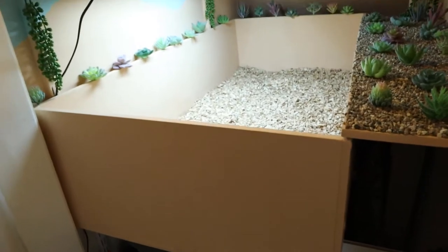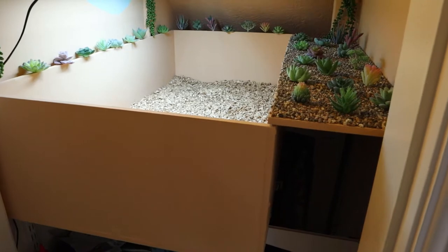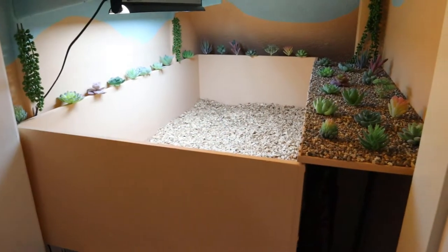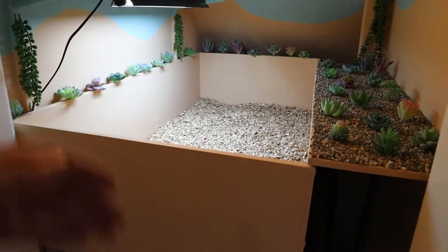If we start with how we actually fitted it up here off the ground — we put brackets into the wall, so there's brackets into this brick wall here on the left, and then on the right we did brackets into the studs. Then there's bars across which support the actual weight. There's 80 kilogram weight bearing on each side, so it's more than enough to keep this guy safe. We basically went to B&Q and got a load of boards that we cut up. The bottom is one pre-done sheet and then we cut another board in half to make each side, and used offcuts to make the ends. It's about four foot by two foot, so it's nice and big.